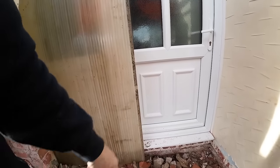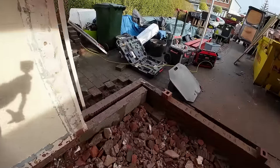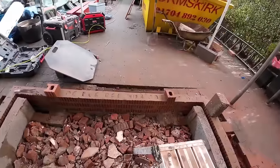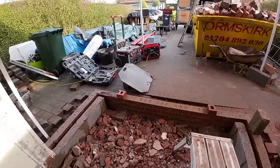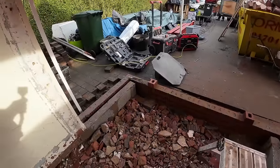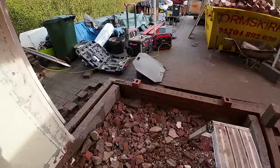The whole floor. So we planned on concreting today, which we still could have done, but the customers decided they don't want two brick pillars, they want 2.5 brick pillars. So we basically have to adjust these two little pillars in here, put a course of brick on the top and another course of brick on the outside up. So basically take everything up a course. We've got two solid concretes left, so we'll just cut them down to give us that 3-inch piece.